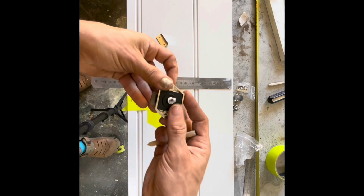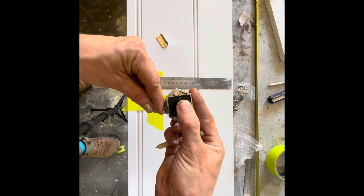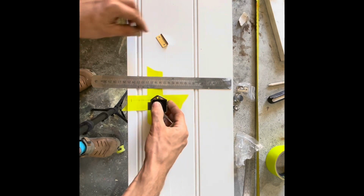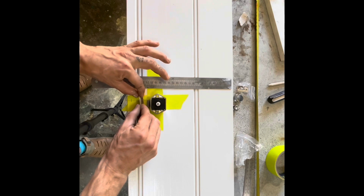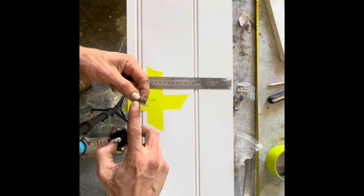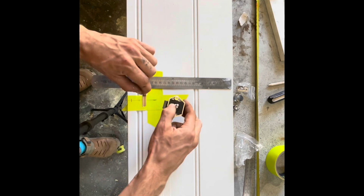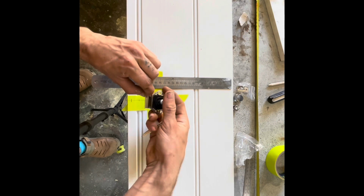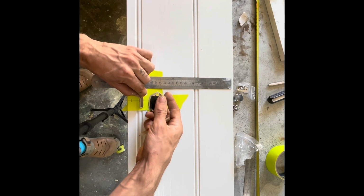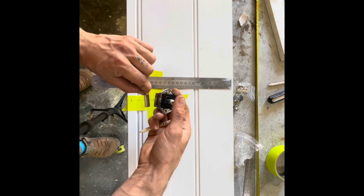These are quite deep. It's a lot that comes out. It doesn't need all of that, you know. It could still lip onto that and be fine. So yeah, that comes out quite far, which means you're better off leaving a slightly larger gap than this, because if it were too small, then it would hit, and we don't want that at all. So that plus a mil gives it plenty of room for this, because it's quite large, and ensuring that they don't scrape when it closes.